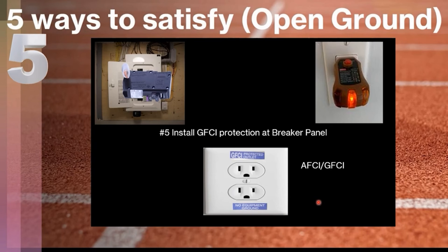One important note: none of the methods listed in this video — except for rewiring it — are going to satisfy the requirement if your piece of equipment needs a grounded outlet. The GFCI does not provide a true ground; it just provides extra protection because if there is current leaking, it will shut off. If you have sensitive electronic equipment or other equipment that requires a grounded outlet, the only way to satisfy that is to physically fish a wire using one of the methods listed in NEC 250.